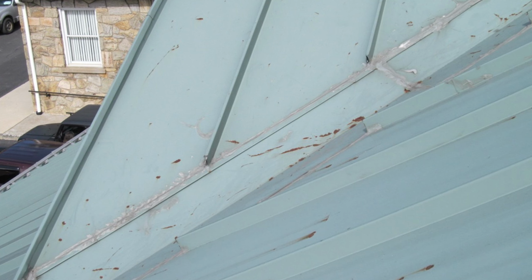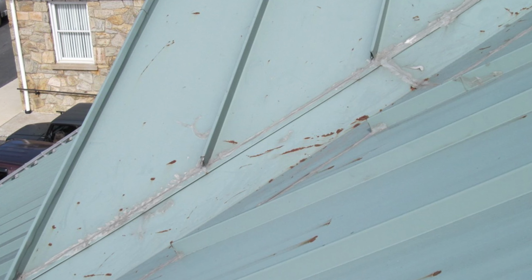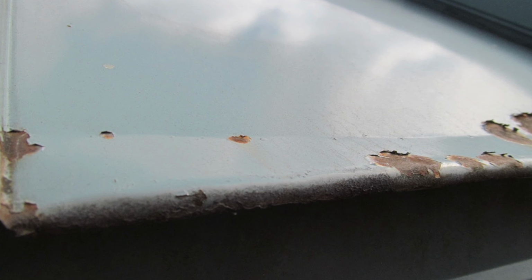A lot of questions we get are, is there surface rust? Does that matter? Can I just paint over it? Do I need to make some kind of adjustment there? Is that going to affect my decision on replacement or repainting? So when we look at a roof, we look at it holistically from an inspection standpoint. We want to get on the roof, identify the conditions, and see what needs to be done. And to answer one part of that question, if you have surface rust, if you have oxidation, if you have things that are basically affecting the substrate, they have to be addressed. They can't be covered up, because if you do, you're just going to exacerbate the problem. So you're temporarily covering it up while your rust is still there, active. So there's a whole level of surface cleaning, surface preparation that needs to be a part of a renewal process when you're going to think about putting an architectural coating system onto an existing rooftop.